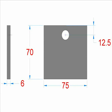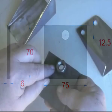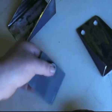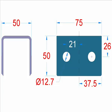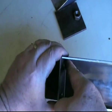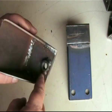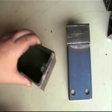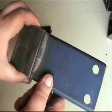As with the drilling jig, this piece is cut from a stock standard 75mm wide flat bar. Prior to welding this piece in place, a half-inch nut is welded to one side. To cap off the small wedge, another piece of channel is cut from 50mm tube, with half-inch holes drilled at these locations, after which you can weld these two parts together on the inside of the wedge, and also with the large wedge and backing piece, making sure that the edge of the piece is level with the back of the channel.